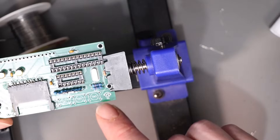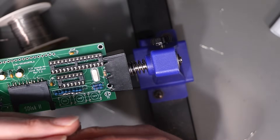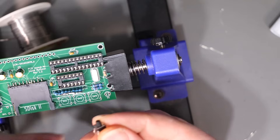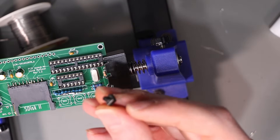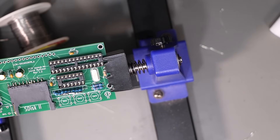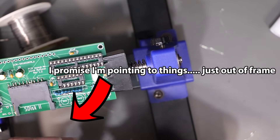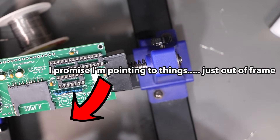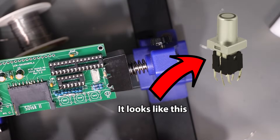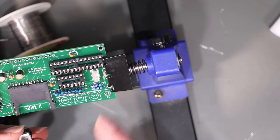I think I'm going to put in the three switches. Because I intend to build a case for this, the buttons I should be using are micro switches — just your regular 3mm. I was going to try and get some 6mm ones but Jaycar was out. So for the hell of it, I'm going to try these big ones. These are actually six-pin, but the middle pins are actually just for illumination. Since this doesn't support illumination, I'm simply going to snip out the centre pin and solder these in.